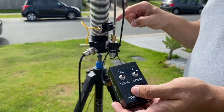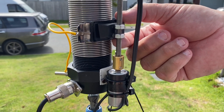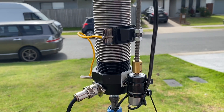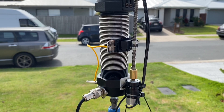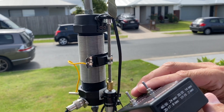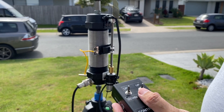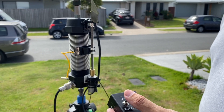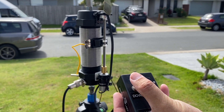If you come in really close here, you can see the motor is driving the shaft — moving up at around about one coil turn per second, which gives you an idea of the speed. That's around about the 20 to 22 second mark, so that's our 30 metre point. To get up to the 20 metre band it's another 14 seconds, so we move it on up — and after around about the 13 to 14 second mark, I can stop it.